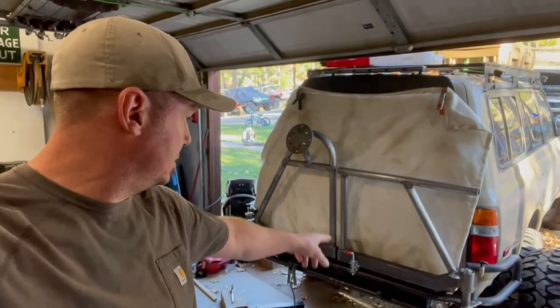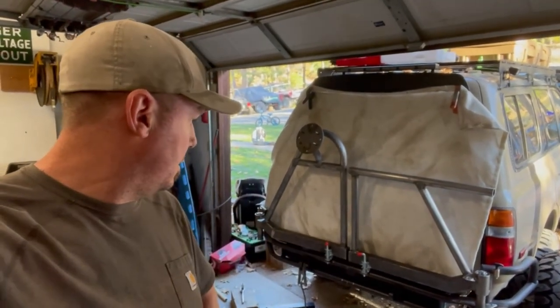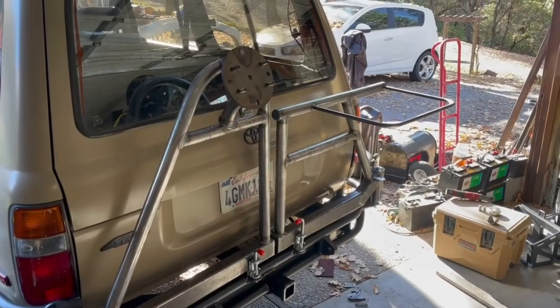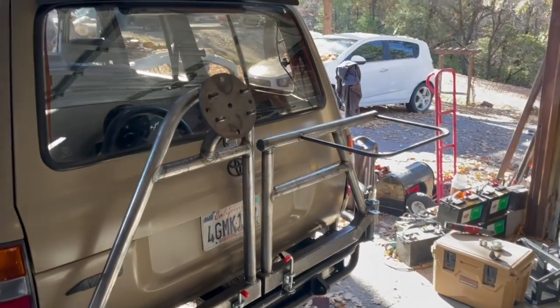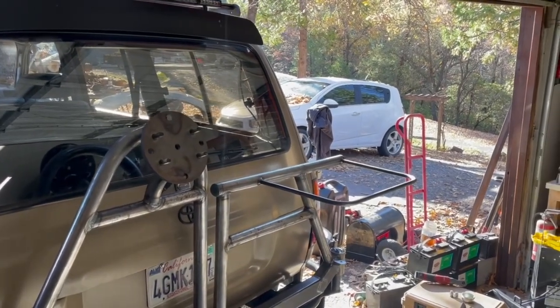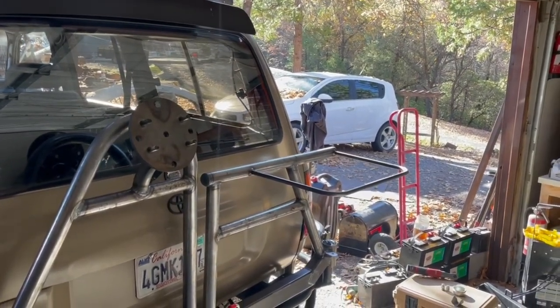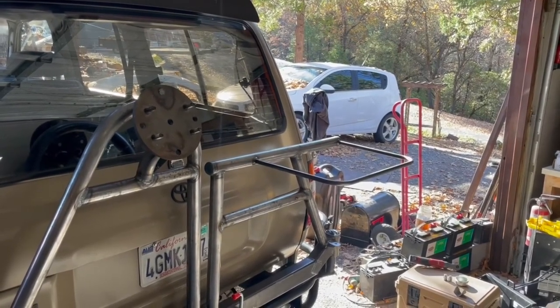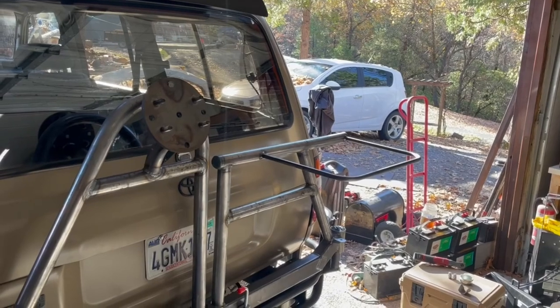He's got some filler pieces he's gonna put down the bottom there out of some sheet metal. I'll walk you through it. All right, here's the start of the ice chest carrier. We just did a half inch bar we bent up into a horseshoe. Got it welded in, and we're gonna create a little sheet metal basket with some dimple dies to get a little more strength, and we're gonna tie it into that bottom bar there.